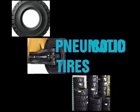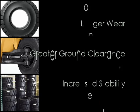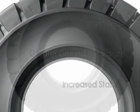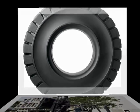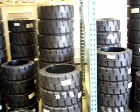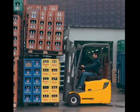Solid pneumatic tires are a full-size profile tire which results in longer wear, greater ground clearance, and increased stability. The concave sidewalls improve shock absorption. Solid pneumatics reduce cost and downtime due to flats and improved stability. They cannot be over- or under-inflated, and they can usually last three times longer. Pneumatic tires are two and a half times less expensive, provide a soft ride, and protect the equipment, the operator, and the loads.